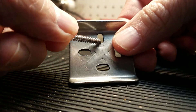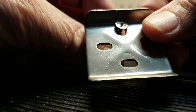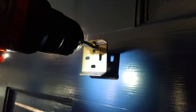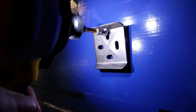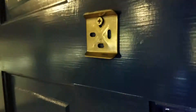We place our drill bit and make our hole. Now we take our little bracket, using the vertical slot on the sloped edge, and put our screw in. Because of gravity, it's going to hang down straight and level, then we'll put our second screw on the bottom. I've got a bit that's camming out, so I'm going to switch to a different bit — switching to an impact driver with a P2 Phillips screw head. See if that makes a difference.